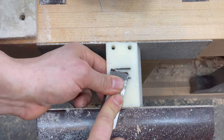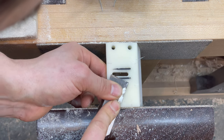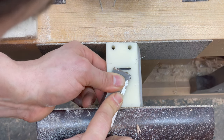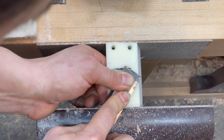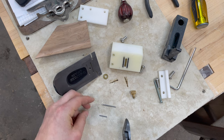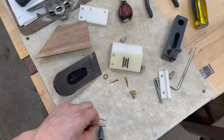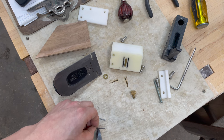I pared any melted polyethylene off the face of the fence. Two new brad nails clipped to 75% the length of the nails used to melt the grooves in the fence were used for final assembly.